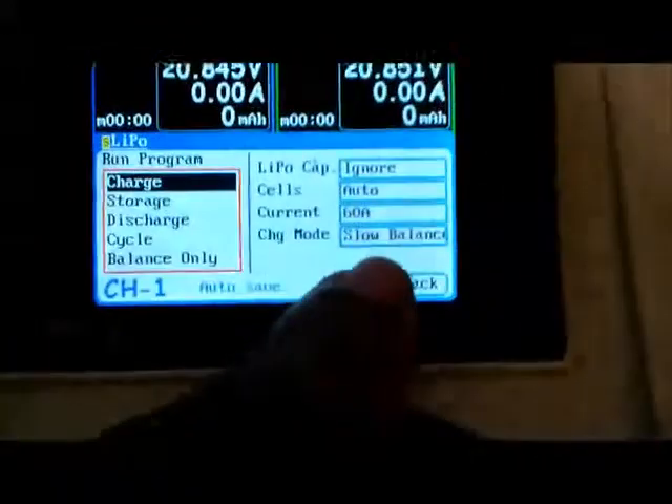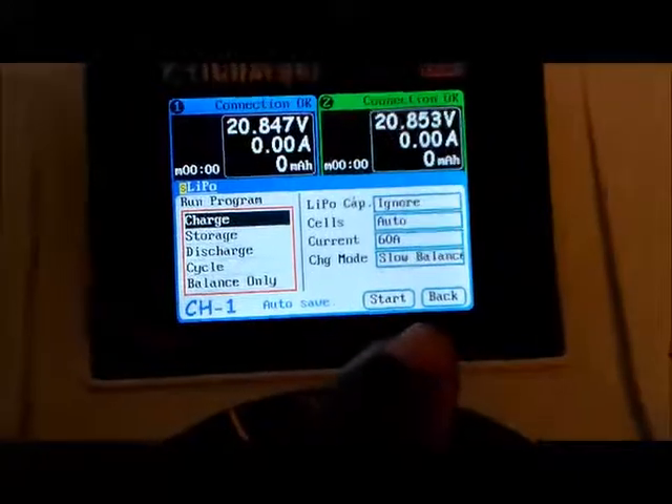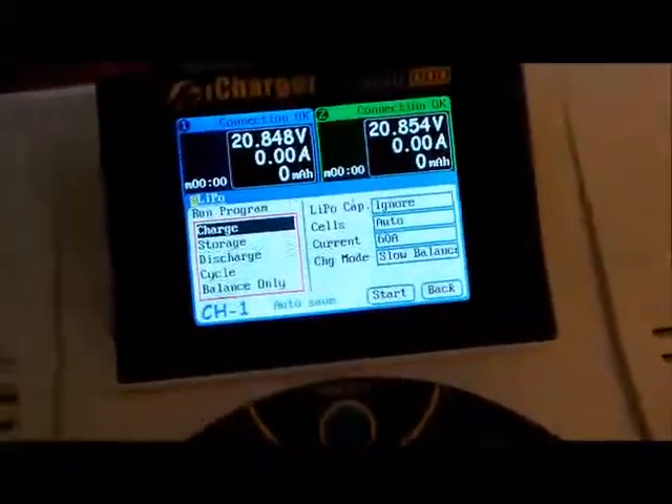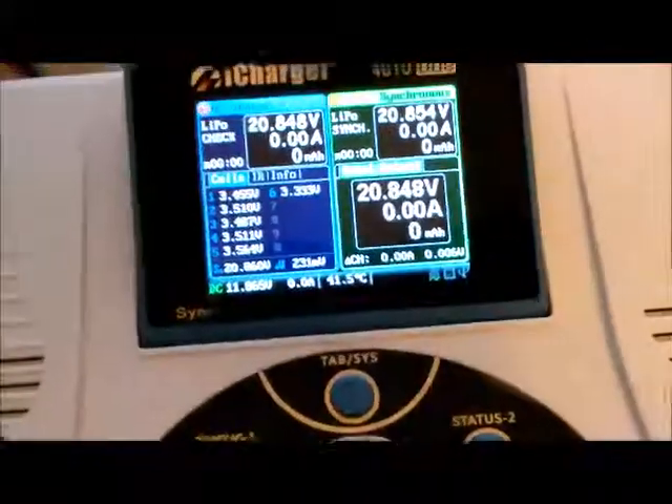It's set at 60 amps — it's not going to charge at 60 amps, it's going to charge closer to possibly 40, 45. I'm also going to undo this fan mod, since I'm going to be heavily loading this power supply down, so the fan should be ramping up.